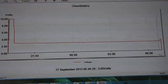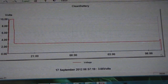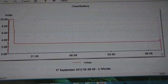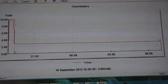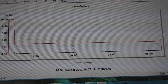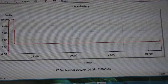At the very end, when I disconnect the LEDs, it jumps back up to 3.05, even 3.10. What's important to notice is how this acts like a normal battery when you give it a load — it goes down. It went from 3 volts down to 2.80, 2.75, 2.65. It was a gradual decrease, as you can see. I ran the test from last night to this morning, and it's a gradual decrease.